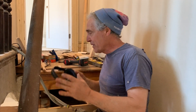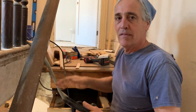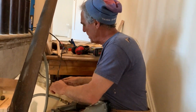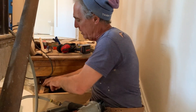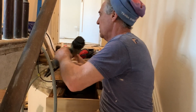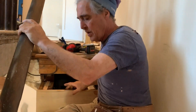Everything on these jobs - when you're working in here you need a nail gun, a little trimmer tool, chisels, your gun and your levels. It all gets piled in one layer and you can get real claustrophobic about it, but you try to keep your patience. We have a little disparity in our level, so I'm going to put a shim down here. I put a little bit of polyurethane glue down with this shim, nail it down, and now we should get a pretty decent fit for this riser that we just cut.